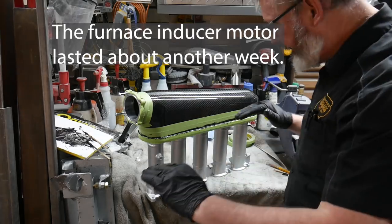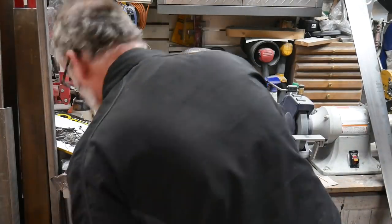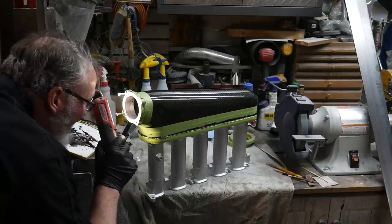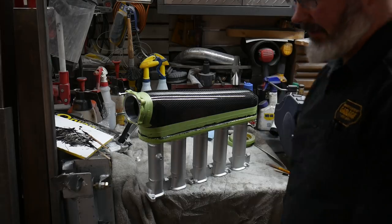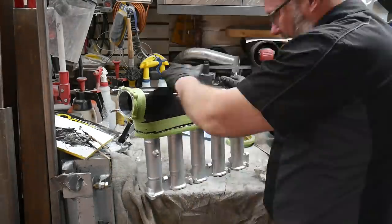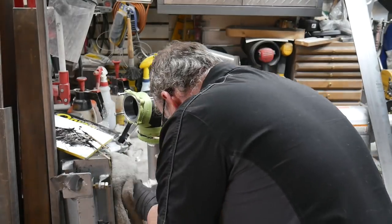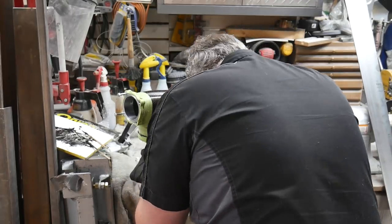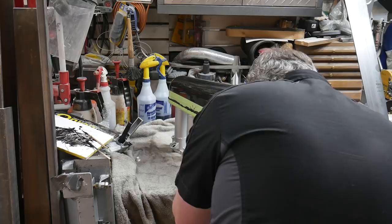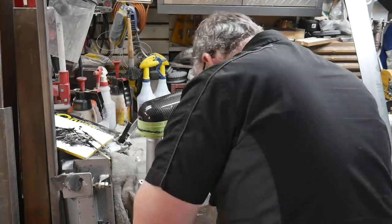The tape line is my reference for where everything should be — the tape line is showing me that, in essence, we're down. Get a flashlight, verify the inside, which looks perfect. Wait for three days for it to dry. I did play around with it quite a bit more just to make sure, and even ended up putting a few clamps on it — very gently, because the clear is still a little bit raw at this stage. Then I just tidied it up — removed any squeeze-out on the outside. You really don't want to have to sand this kind of material when it's done. So as it gets fairly hard, I just used a little bit of lacquer thinner on a paper towel, went around the entire surface, and ensured it was perfectly clean.